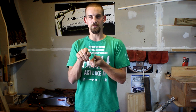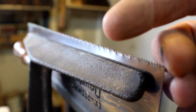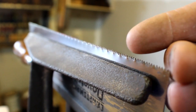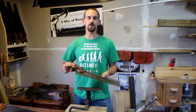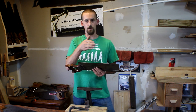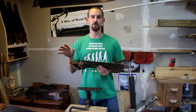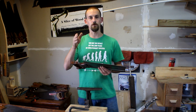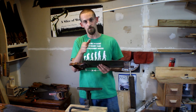For this saw blade, there are four teeth going one way and then one coming the other way. You can see that pattern — one tooth leaning one way, with four in between each of those alternating teeth. Because of that awkward tooth set, I didn't really want to mess with resetting them, so I left the saw as-is. It cuts fine, but for doing fine straight lines it can sometimes go off to one side because of how the set is.